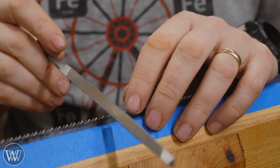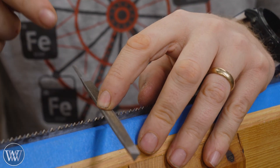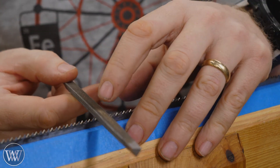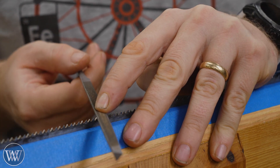If you don't know exactly what you want, set your file in there and see what the last person sharpened it at. You can actually set it up to whatever that rake and fleam is, because the tooth will generally hold right at whatever angle it was last sharpened at.